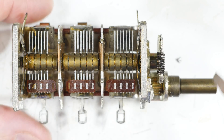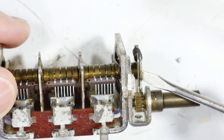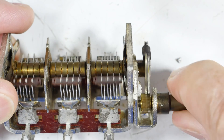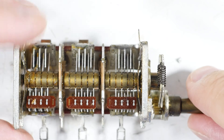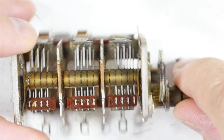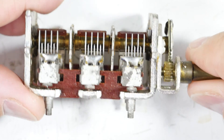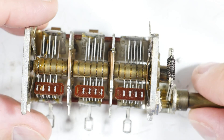This one is very unusual - it actually has a gear up here on the front. That gear is split into two - two gears with a little spring putting tension between them - and the other part of the gear is on the shaft. This ensures there's no backlash when you turn the shaft back and forth, keeping the gears tight together. It's a three-bank capacitor. On the bottom it has two trimmers for the back side and nothing for the front side - so it must have gone into some very specific item that's lost to history.